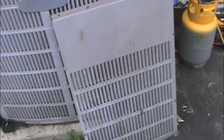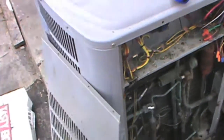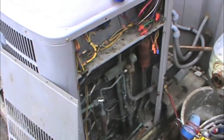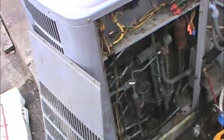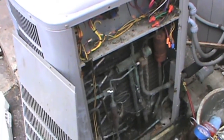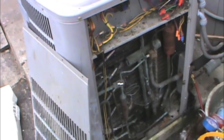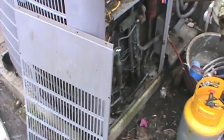It's a heat pump, so it's supposed to have an auxiliary backup on the inside. Maybe the thermostat's not working right, maybe auxiliary's out — we don't know. We're going to check it out. I think another company already told them they needed a new condenser, but there's a language barrier here. This is a Chinese restaurant, so we're going to get up there and see what's going on with the strips.